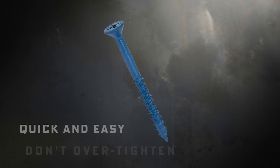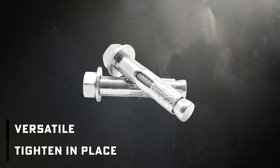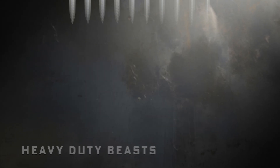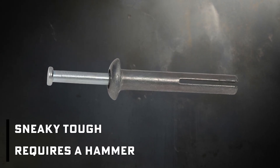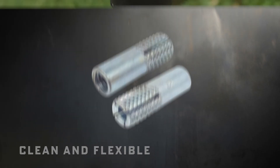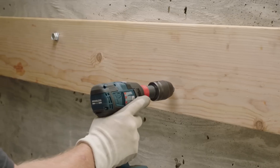That's really the case with any type of hole drilled for concrete anchors — mechanical and/or epoxy. Clean and vacuum out that hole or you could have some serious issues. Here's the recap: screws are quick and easy, really important not to over-tighten them. Sleeves are versatile, tighten in place. Wedges are structurally heavy-duty beasts. Pins are lightning fast and require a special tool. Strike anchors are sneaky tough and only require a hammer. And drop-ins keep it clean and flexible if you want to hang a threaded rod.